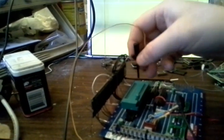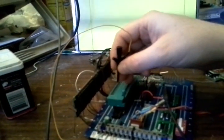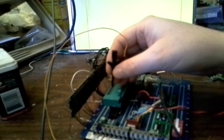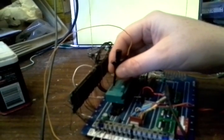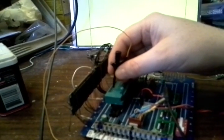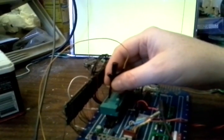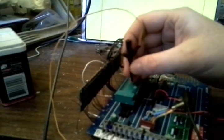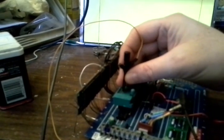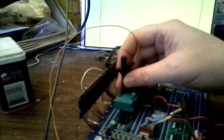I wonder what'll happen here. So it's not necessary for free running to do this, but I did it just to make it a little easier to see what's happening. So some of the address lines still have the address being continuously output, even though the only time that the address is actually necessary is during the one command, which would be almost impossible to see. So let's see, we've got one. Well, it's power, right? So power. Dun, dun, dun. We should probably see something there. So this should be one of the address lines.